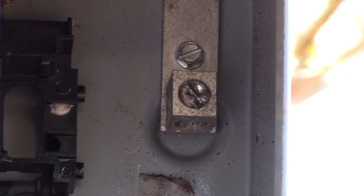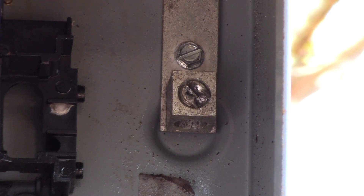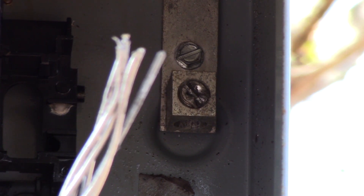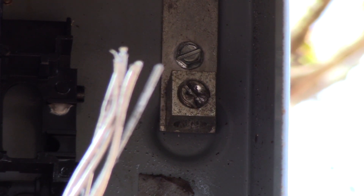I've got good voltage — 120 volts from each leg to neutral and 240 volts between them in the main breaker cabinet — but we did not have a neutral connection going to the barn. So I've got to somehow get that lug out before I can make a repair here.